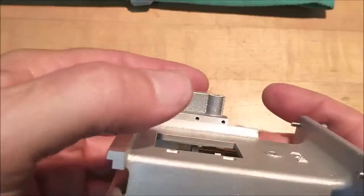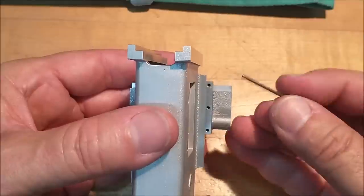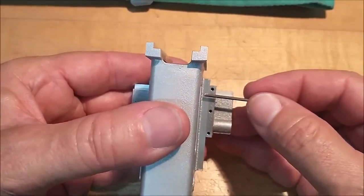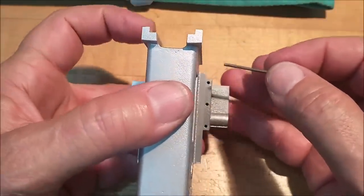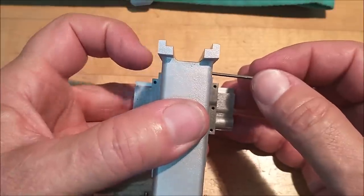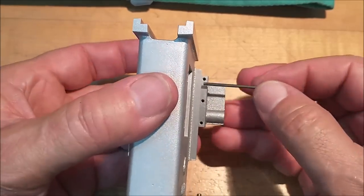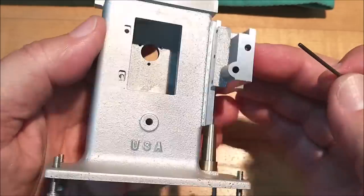I do not have the covers on these. When the covers are installed on this, they are extremely close to the face of this casting right here. And I think this is a very good prime example as to why these features and the features on the face must be symmetrical to the center line of the casting and nothing else. Whatever happens, happens. It's got to be symmetrical to the casting, or all of the rails that go here will bump into the main body of the casting.